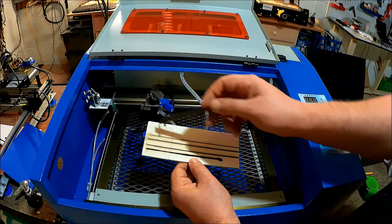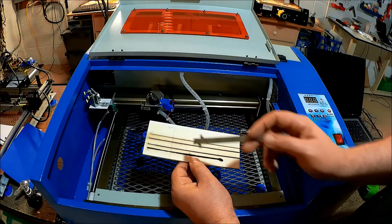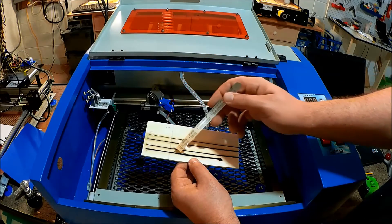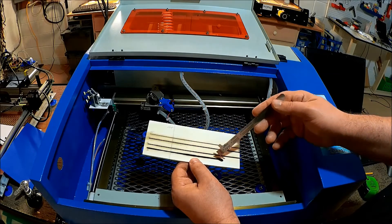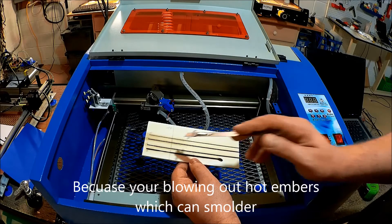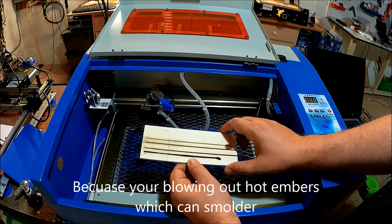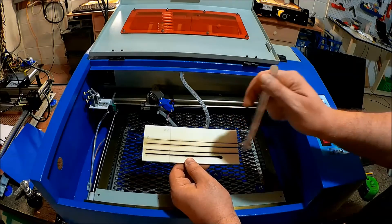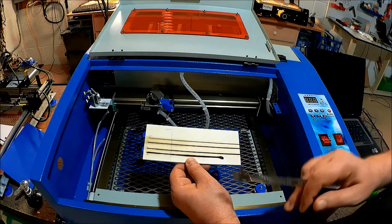You can turn up your air a little bit — I used constant air settings on all of these — and that's probably something else you want to experiment with, because the air is going to blow out the channel and remove some of the charred material. Be a little bit careful with that too, because that can be a fire issue in the evacuation of the fumes. A little bit of safety first there. Long story short, this is an effective way of determining speeds and feeds for new materials.